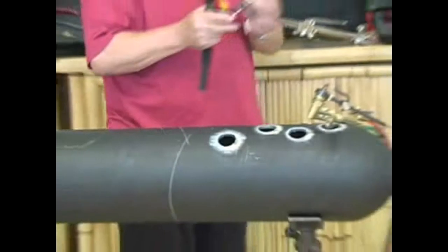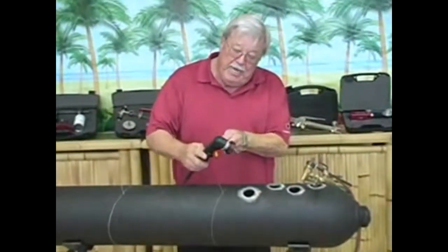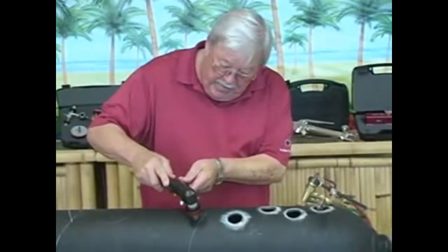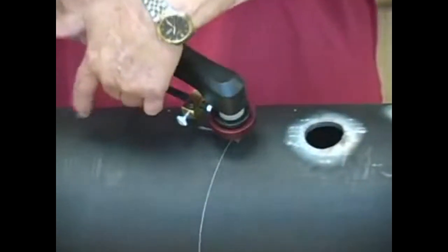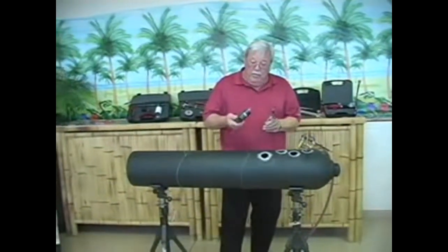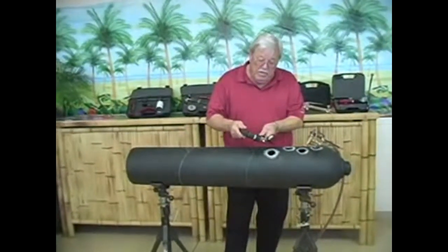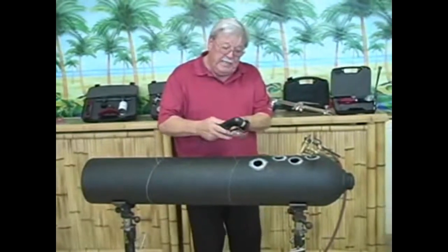The same tool, only for plasma. You have to order the right bushing for your plasma torch. You do the same thing. Put a center punch mark, and all you do is pull it right around. It does a beautiful job. If you think that's clean, when the plasma blows through, there is not a blemish in it. But always order the bushing. Your bushing comes with the tool, but order it along with the tool. There's a part number for your bushing at the same time.